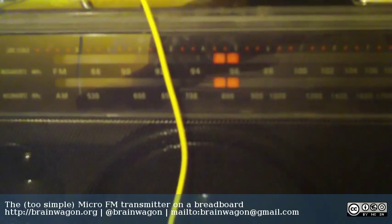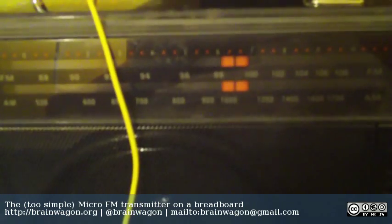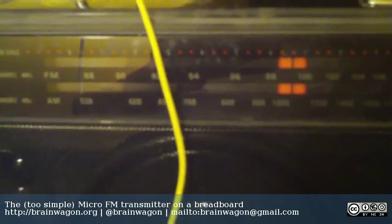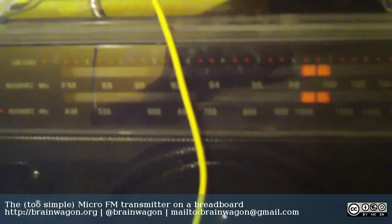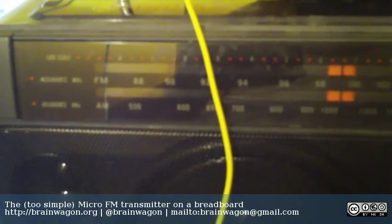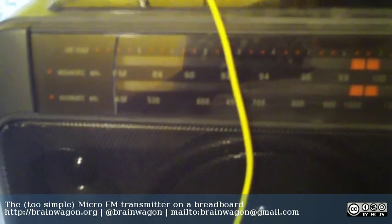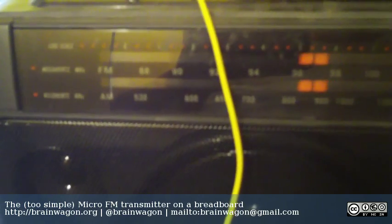One of the things that's slightly bad about this circuit is — you see, I'm right here around 93 FM, and if I tune up... here it is again up at 99 megahertz. Actually it sounds a little better here. So there are all sorts of spurious frequencies that this thing appears on, which means it's actually throwing power out on multiple frequencies scattered all over the place. I found like two other images of it below here. I can't really recommend this circuit for anything but the absolute most primitive experimentation. If you really want a small radio circuit that can broadcast to an FM radio, you should probably pick a different one, because this is just a little wonky.